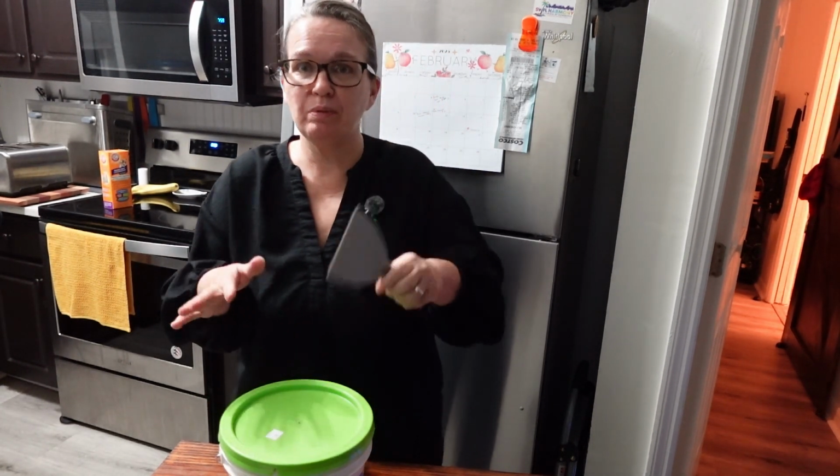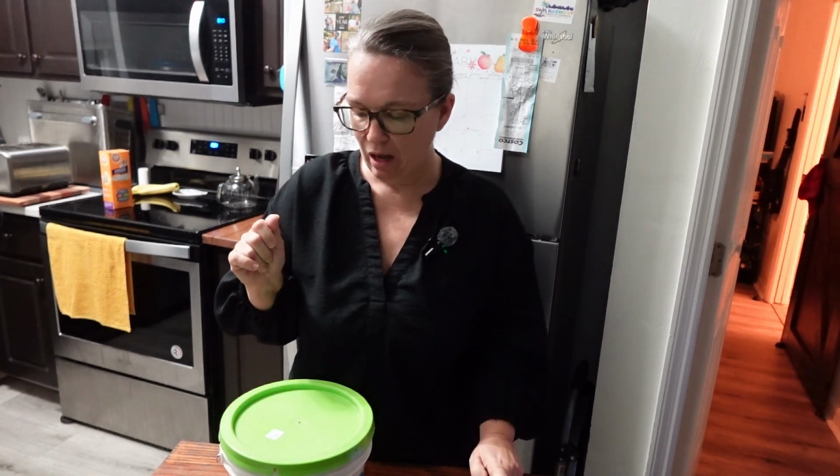Cleaning up wise, I really don't feel it was much different than traditional grout. Applying, I feel, was smoother. It had almost like a frosting feel when I applied it. But yeah, overall, much easier to work with than grout. When you scoop inside, this was much neater to apply, but then the final cleanup, the washing, you still got the haze if you didn't do it right, all of that jazz. But the application, all of that really was easy. There were no fumes. I would recommend this.